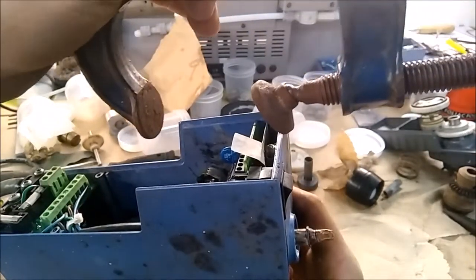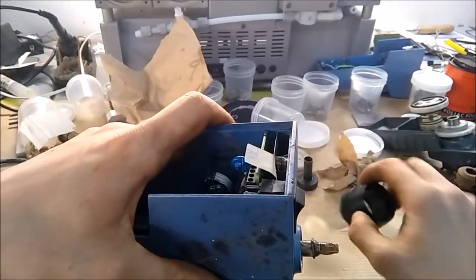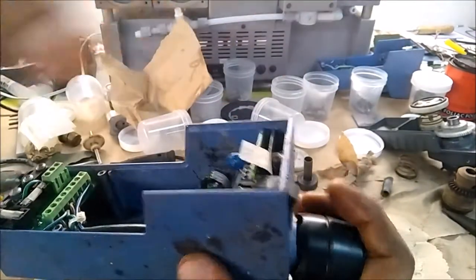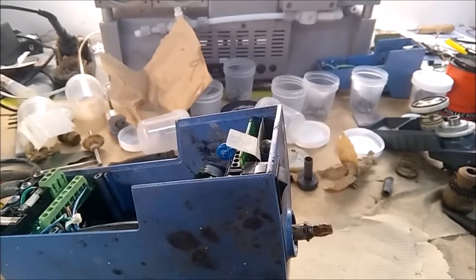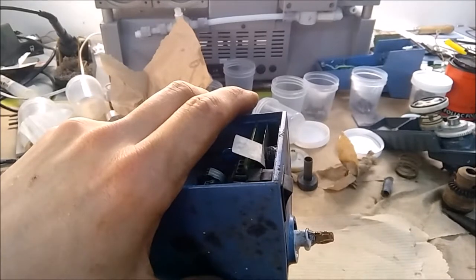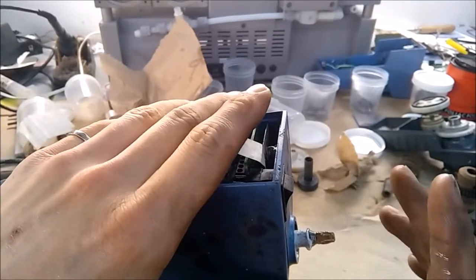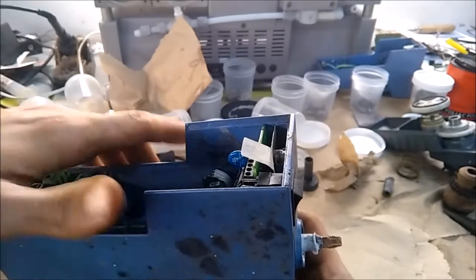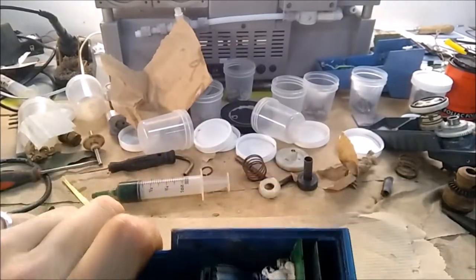For indexing: the flat part on the front for the shaft keying is 180 degrees from the flat part on the back side — they're opposed to each other. Line up the flat part where your spindle is currently facing. Push it in — if they don't cooperate I just use a C-clamp as a press with a spacer on the front. Ideally you shouldn't need to if you've cleaned up everything correctly with no burrs. Just throw a little more lube on here because this is a brass piece inside an aluminum casting — with acid vapor you get galvanic corrosion and these get horribly seized in place.